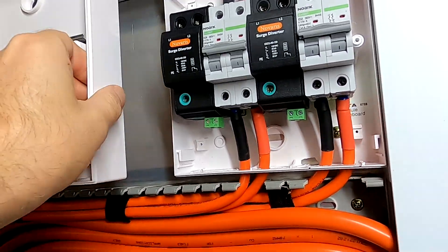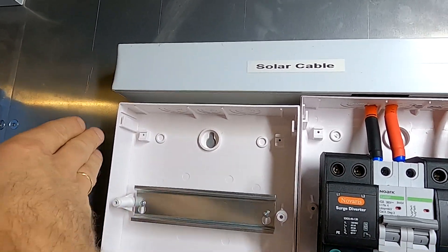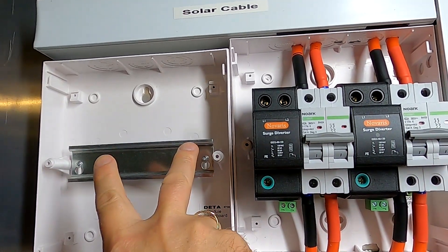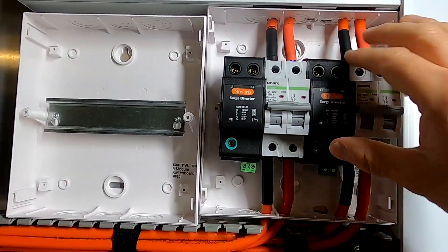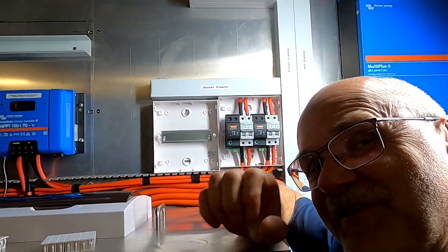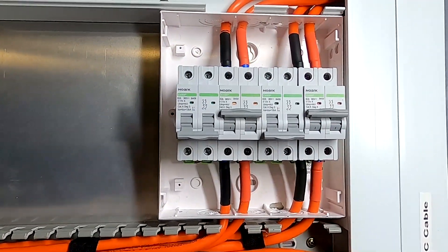The alternative would be to have a second switchboard here in this location, which was actually the original design. You can see the duct is already long, covering two switchboards, and then two more fuses and two more surge diverters — same setup as on the right-hand side for the other two roofs. Decision made: we go with one combined solution, no surge protectors, and leave the second position unoccupied.